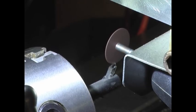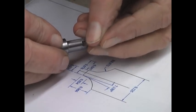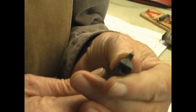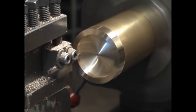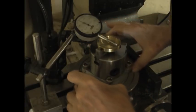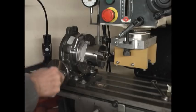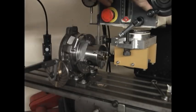I've mounted my Dremel on the quill to control the grind, which is done using an abrasive cutoff disc. The cutter is clamped in the tool holder from my home-built slotting attachment. To make things more interesting, the teeth on the ring gears will be cut in a blind hole. This is a home-built slotting attachment I built for my mill, specifically for this job.